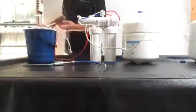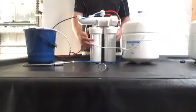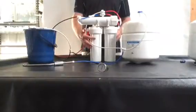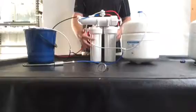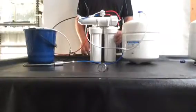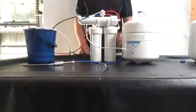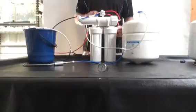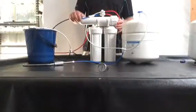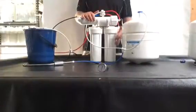The system is actually turned on and the water is pressurizing it. It goes through here and through the first stage sediment filter, which takes out dust, dirt, rust, and sediment before it goes to the second filter, which is your carbon filter. This first filter also protects the carbon filter from blocking. The carbon filter will take out chlorine before it goes into the membrane, because the membrane itself is prone to attack from chlorine, so it's important that this cartridge is changed regularly.